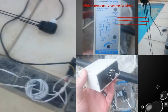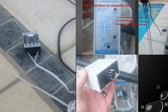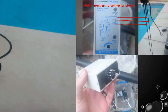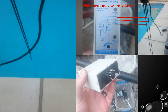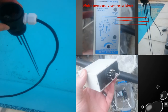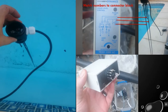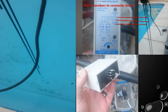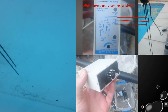Because I'm running a pump, it has to go through a contactor. For this test, you'll hear when the contactor clicks in — the pump will go on and then off again. I'm testing in the water of my swimming pool. We don't want it to activate when the water is at a low level in the tank — no activation there. You can hear it just clicked in; now the water will drain. We want it to go off at the medium probe — and there, you can hear it's just gone off. I'll show you how we install that into the tank next.